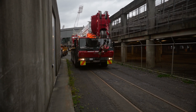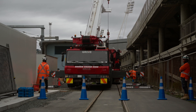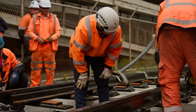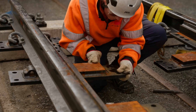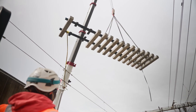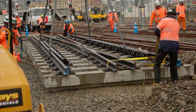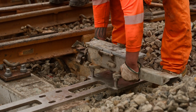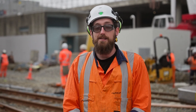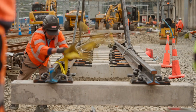From here onwards, at about 10 o'clock, we've got the crane coming in. The crane will be lifting in four pre-built turnout sections. The turnouts arrive in the country as a kit of parts, like a Lego kit. The guys pre-assemble them in halves, then we use loaders or cranes to put them in place on the network, before finally seating them with a surveyor and welding them down. By the end of this weekend, we should have those panels ballasted, welded, and aligned correctly, ready for the tamper to come in.